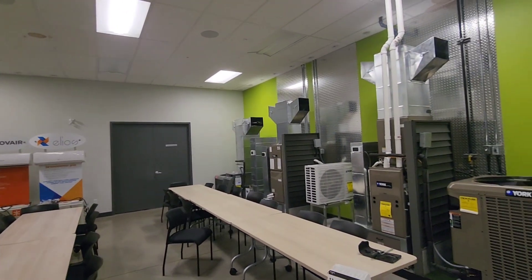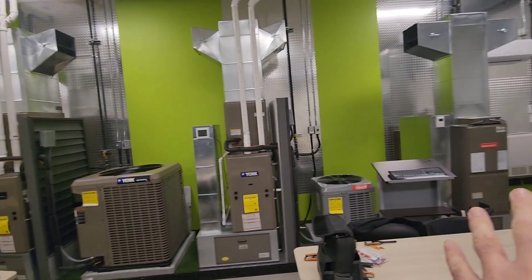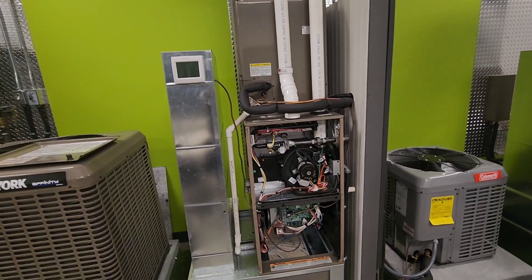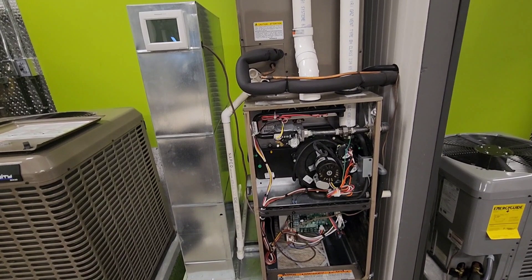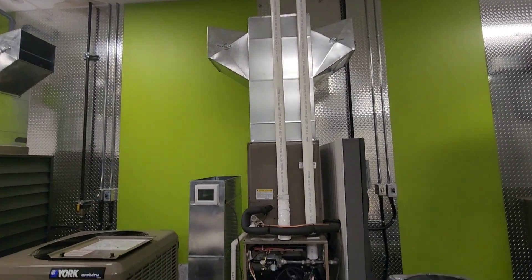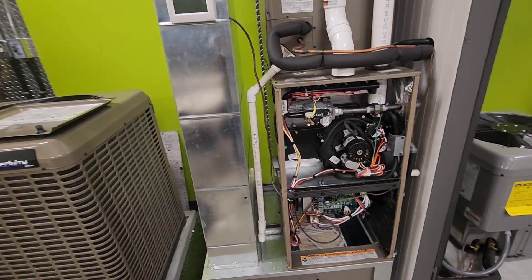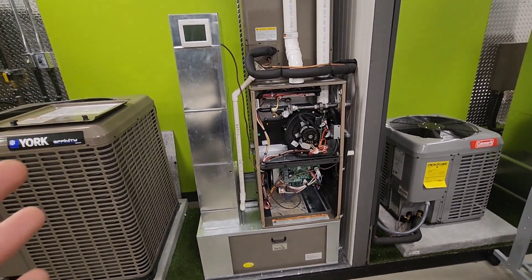This video is being filmed at the Master Vaughan Distribution Center in their training room, and they have all kinds of setups here that we can utilize to run these training videos. Keep in mind that when we check actual capacity output, the numbers might not be the same as we would see if this unit was installed in a residence with a fully pressurized duct system. This is just to show you that there's a way to do this and how to complete this exercise so you can use it for diagnostics and showing the customer that there's something wrong with their system.